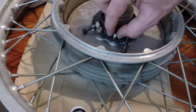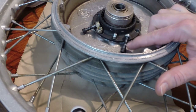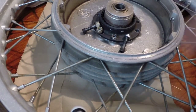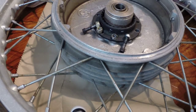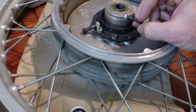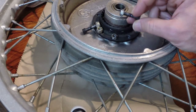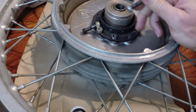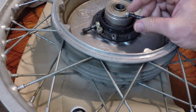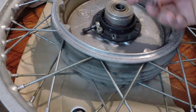I found some very shallow nuts locally, and using those with the cap head screws you can get it to work — that did leave enough room for the final drive. But honestly I decided not to go this route. These very shallow nuts only get maybe two threads of engagement, they're very weak. I stripped out a couple just trying to tighten them down, and even when finished you've got so little clearance between the nut head and the final drive — it just felt week and kind of dangerous.